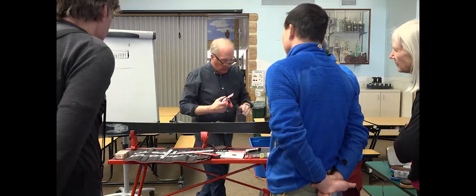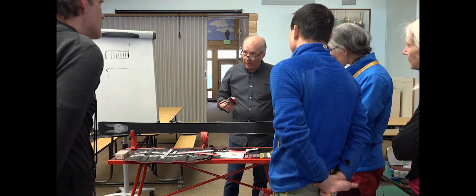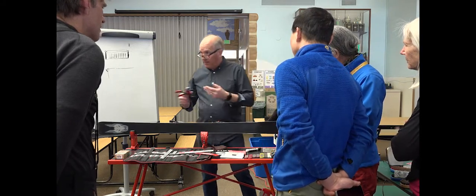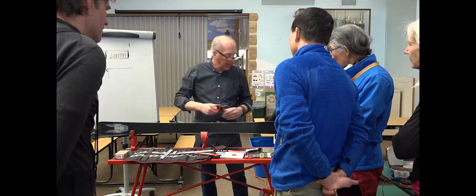And so this is the second one. This still cuts, but it starts to get rid of a lot of the grit and a lot of the striations that the other file leaves. The other file takes off metal, gets it down to the shape. This starts to smooth the metal on the edge.